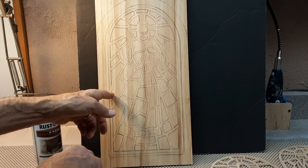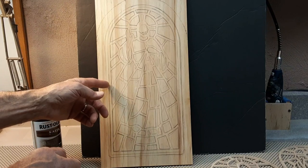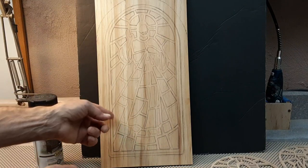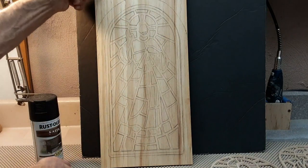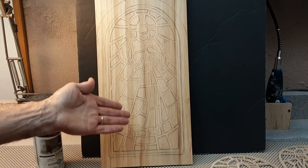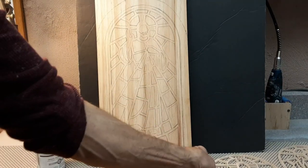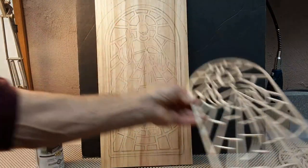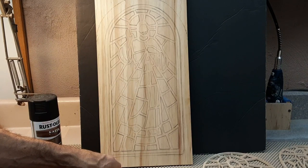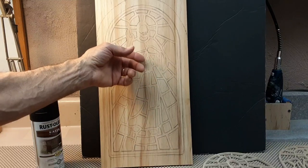In this case, this first frame I want to lock pushing it in, and then the outside frame I want to lock pushing it from the back to the front. I want it to come out about 1/2 inch. So with 3/4 inch pine and 1/2 inch, that gives me 1 1/4 inches. That's going to be enough room to put in my LED lighting, to put this panel on the front of it when it's completed, a backer board, and a stand that's made up of select pine, 2 feet. But we'll get into that later on when we get to this part of the project.